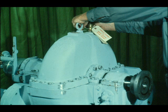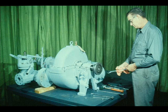Now that reassembly is complete, the turbine is ready to be sent back to its unit. Attach a location tag to the turbine — it will supply the required information to route the turbine back to its unit. In most cases, you will also attach a lubrication tag as a reminder that the turbine must be lubricated prior to operation. Your final step on any job should be to clean up your tools and your work area, following good housekeeping procedures as outlined by your plant.